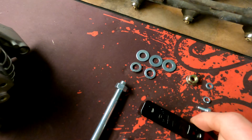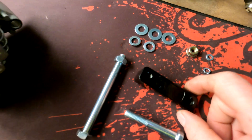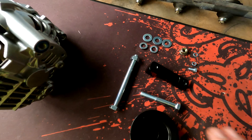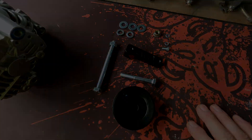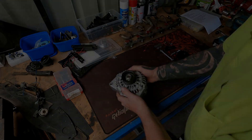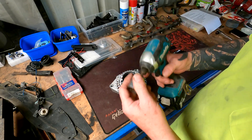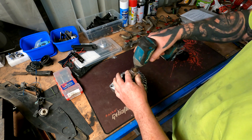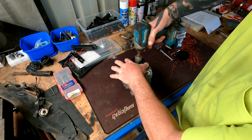There's also this kit from CWC which comes with a new pulley. First things first, we need to get this pulley off. I'm using my little rattle gun or torque gun and a 24mm — that should be enough to get it off.